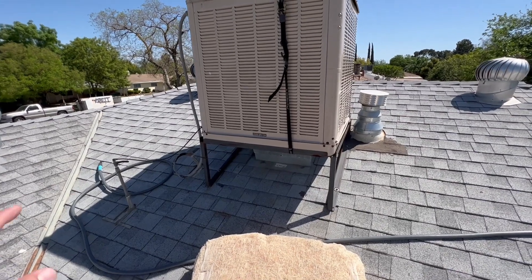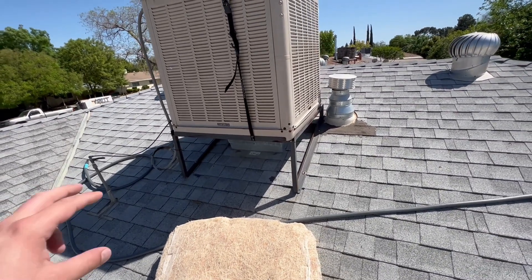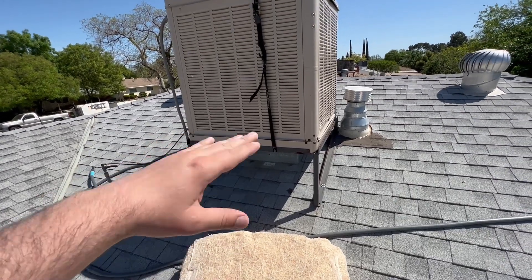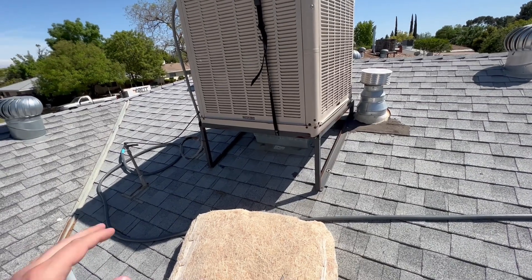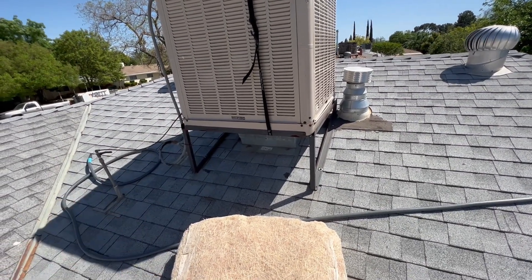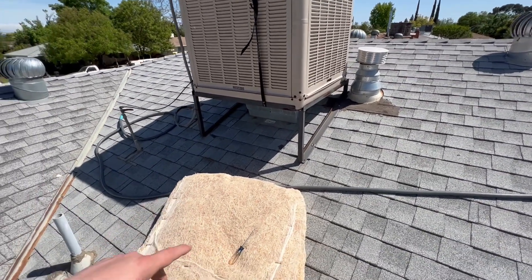During the off season you should turn off all your water so your lines don't freeze and to prevent stagnant water accumulation or the float lifting and causing overflow. If you already winterized your cooler it's just a reverse process, but if you haven't winterized and left it all year, this will help you understand how to winterize it.